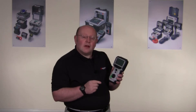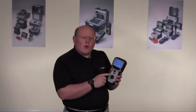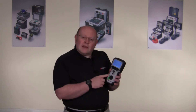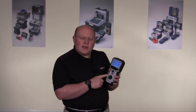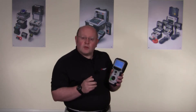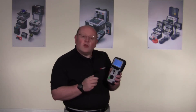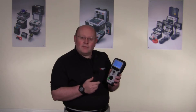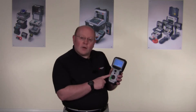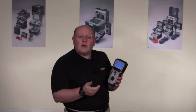The automatic feature on the TDR1000 Stroke 3 has a number of features. Firstly, we automatically set the impedance on the cable, as long as the cable is more than a few meters long — in this case you don't need to read the specification on the product, though you do need to know the velocity factor. Auto also sets up the pulse width to give you the ideal setting for the range selected. The third thing is gain, and auto sets up the gain for you as well. So the auto setting is a simple one-selection option for those of us who don't do TDR measurements all day long.